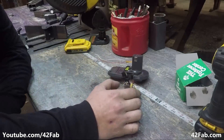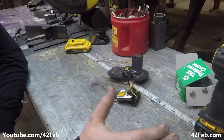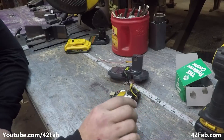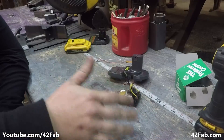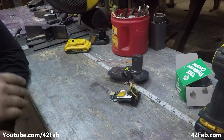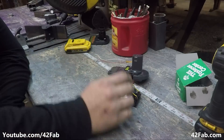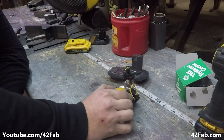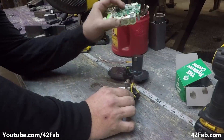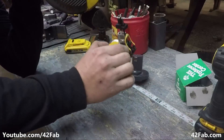Now if you tried to do this — for example take a DeWalt battery and put it in a new Milwaukee or Makita tool — it wouldn't work, because the tool is going to talk to the battery and there's a handshake that tells the tool it's got a genuine battery, the battery is charged, it's not over temperature, and so on. We're getting around that because Ryobi doesn't have that same mechanism — the battery itself protects itself instead of the tool talking to the battery. So we're doing an end run around all that protection with this little board here.